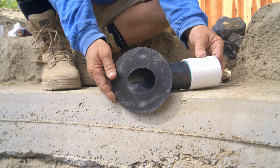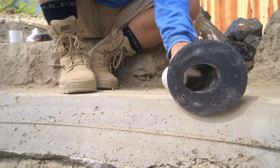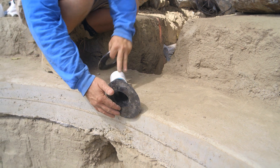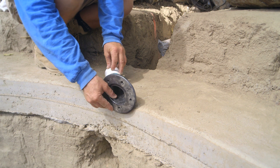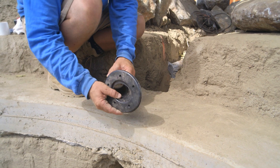This is a versatile jet — it can go left or right, you just spin it around. Once we get it in position, the liner will come up across this. We would have a sealant on this area right here, and then we would take this flange piece and install it over here. Then we can add some screws and mechanically attach this unit, so it keeps the liner in place for a watertight seal.